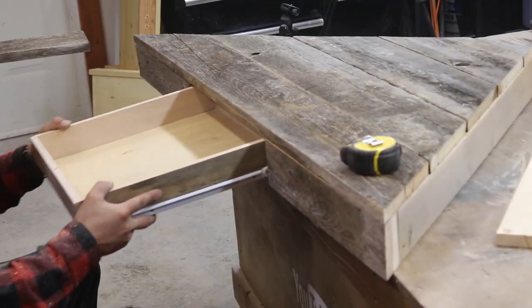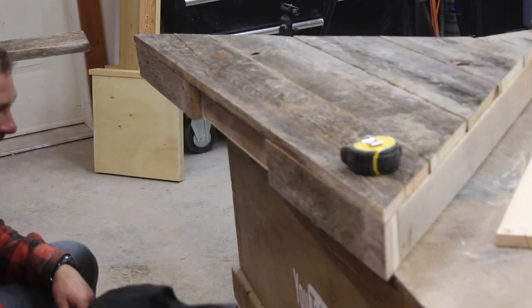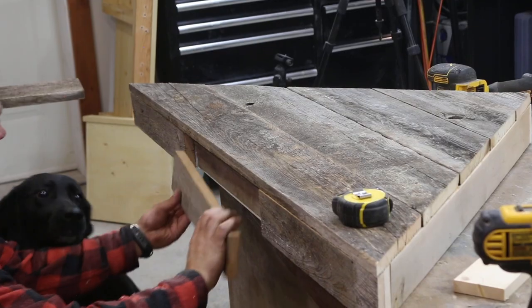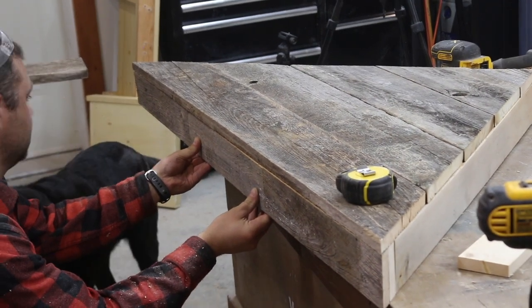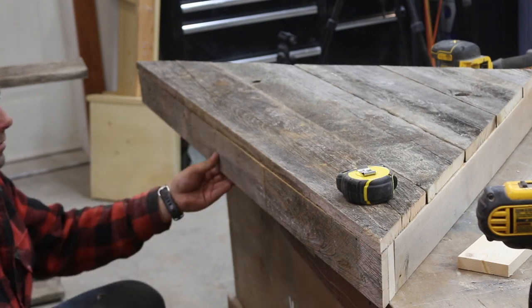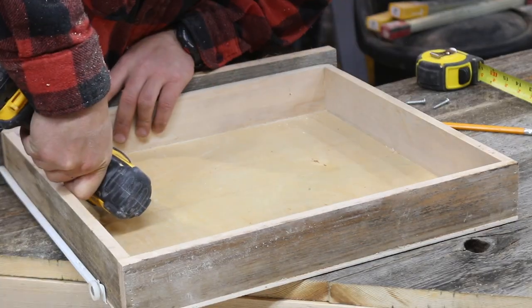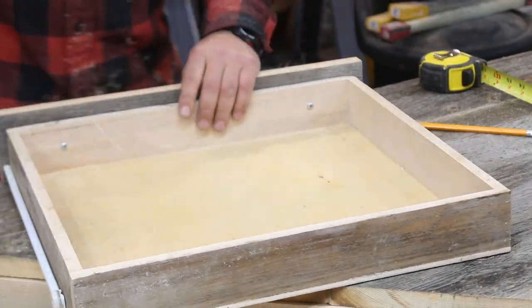Go ahead and test the drawer to see that it will go in correctly and slide smoothly. I then lined up the board onto the drawer so the gaps on the left and right side were even. I tacked the board onto the drawer to temporarily hold it in place. I then opened it and used screws to permanently connect the drawer front from the rear side.